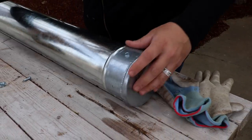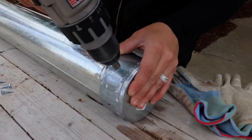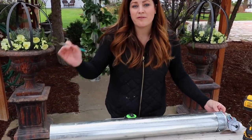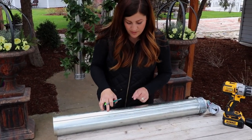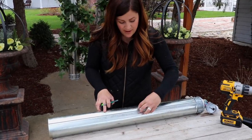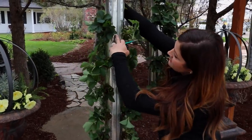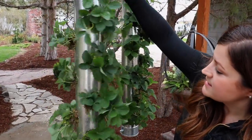You don't have to pre-drill the holes — the self-tapping screws will go right through the metal. Screws are in and the cap is on nice and tight. The next step is to measure my first row of planting holes. We want to do this fairly close to the seam — maybe an inch or so away — that way we don't ever have to cut a hole right over the seam, and we can end up with three rows of holes like on this one. You can see there's plenty of space so the seam stays together but allowed us to get three rows.